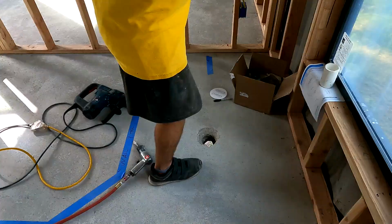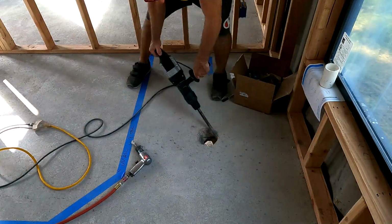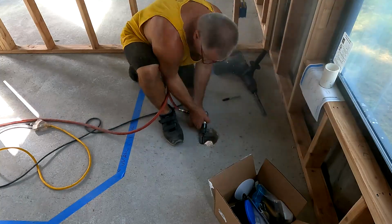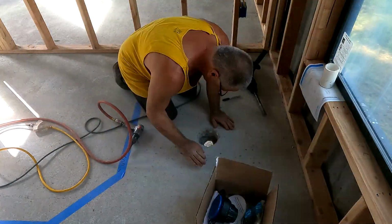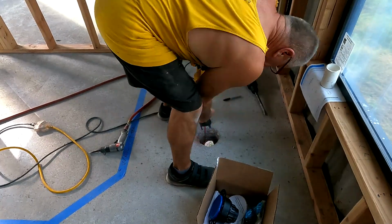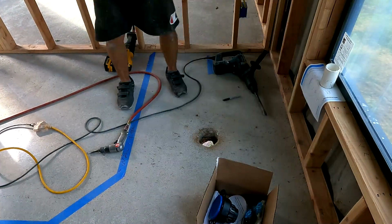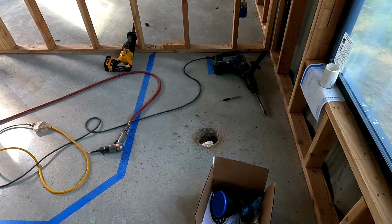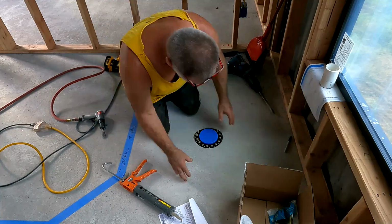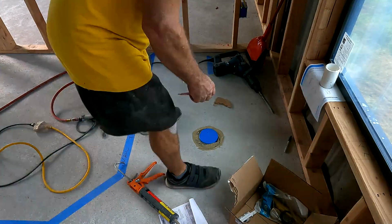That was a hard one. So I've only got the standing tub flange in, the drain actually. It's a special type of drain that lets you attach the pipe to the tub and then basically shove it through this drain setup. The 5-inch hole, I have to make it a little bigger. It's right in the center of the tub, and then I glue the drain in there, and we should be good to go. Kind of nice to put all the dirt through the hole and not have to vacuum. Anyway, pretty straightforward.